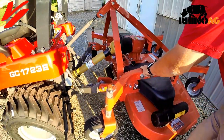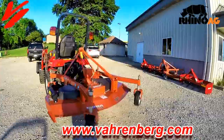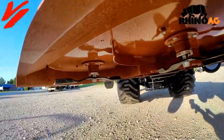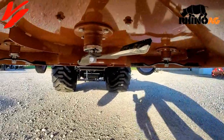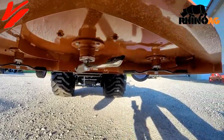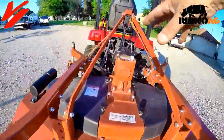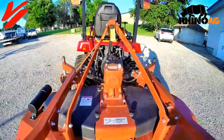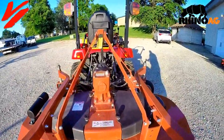The only thing we want to check is we want to tighten that up a little bit. With the finish mower, we're just going to slide the camera underneath here and show you — you've got multiple blades, three blades on this thing. They're a fixed sharpened blade on the edge that's going to cut the grass versus beating the grass. That's the difference between a rotary cutter and a finish mower. You have three belt-driven blades with a main gearbox that runs a belt underneath this cover — that's your key maintenance item along with cutting height and daily maintenance needs.